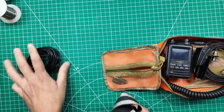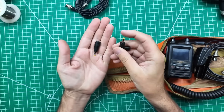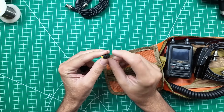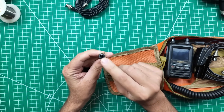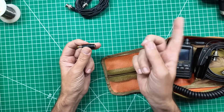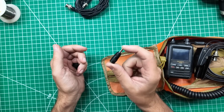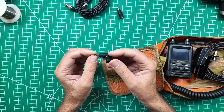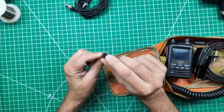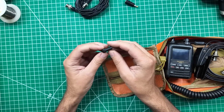There is the coax to go from the radio - BNC on both ends. There is the roll-up J-pole antenna that fits in the palm of your hand. I also have a couple of power adapters. This first one converts from 5.5x2.5mm (5525) over to 4.0x1.7mm (4017). Most DC gear uses 5525 barrel jacks, and I already had an adapter going from Anderson Powerpoles to 5525, so going from Powerpoles to 5525 to 4017 was a no-brainer.